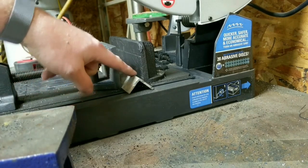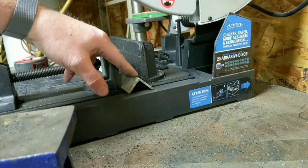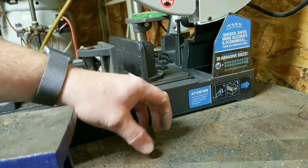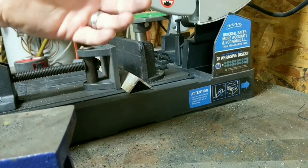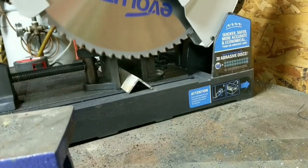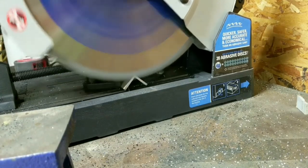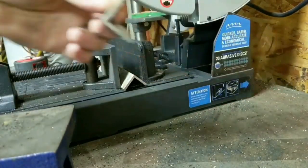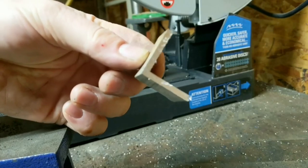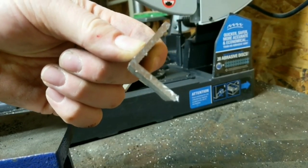Now let's throw some aluminum angle in there. This aluminum angle is a little bit thicker than 1/8-inch — I don't think it's anything standard; it was actually bought on a job site and was extra left over. Aluminum sometimes gets kind of tricky to cut because it likes to melt under the heat. But the nature of these blades is they don't make a lot of heat — you've actually been seeing me pick up pieces of metal that I just cut and I'm not burning my hand. That's completely different than your standard abrasive disc. It cut through that pretty much like butter, and you can see the cut is just a really nice, clean, straight cut. Pretty amazing for the speed we're able to cut these things.